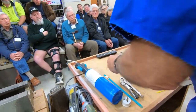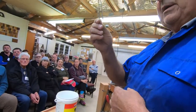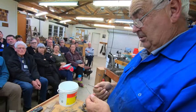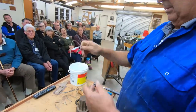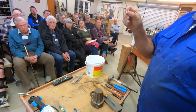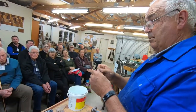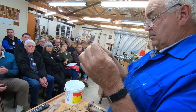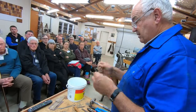Look, it's left a mark. All we did was heat it up and let it cool in the air, and I'm hoping it's not going to do anything and it's just going to bend out again. This one is like your file — heated up and quenched. You saw how easy that was? So that's what could happen to your file, and it took very little to do that.